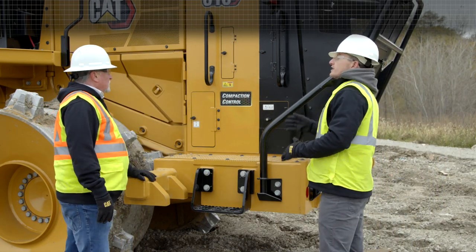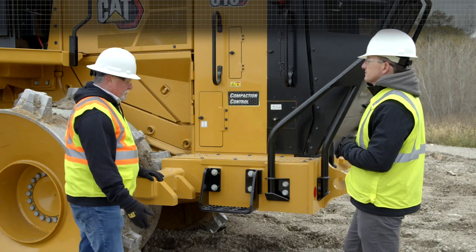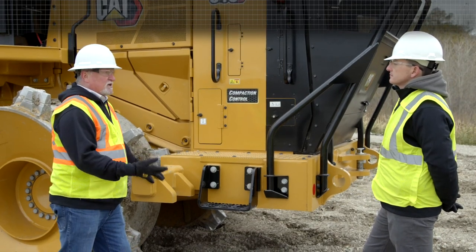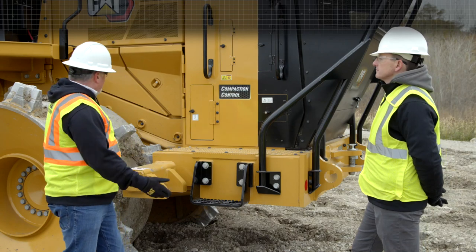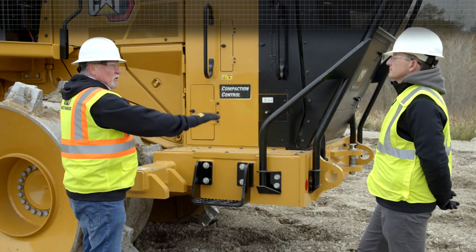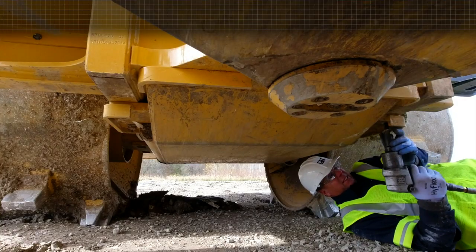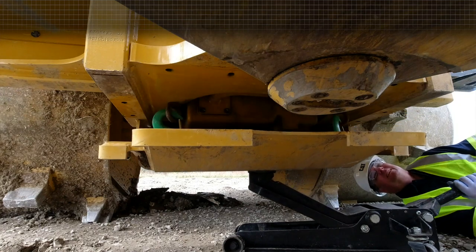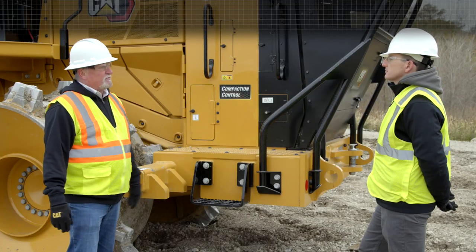Caterpillar really cares about service and maintenance. Let's talk about the smooth belly guards we have on the bottom of the machine to help with maintenance activities. The bottom of our engine, because of our powertrain — our axles, drive shafts, and everything — doesn't allow for a totally sealed surface like a boat, because our rear axle oscillates up and down. What we've done is totally smooth out the bottom, go around it, seal it up, but with access doors down there. You remove a few bolts, it's hinged and comes down, so you can get in there for inspection, maintenance, or cleaning out the engine compartment. We also have one under the transmission and up in front under the fuel tank, to allow access to the steering cylinders and the bottom of the fuel tank — all on hinges.